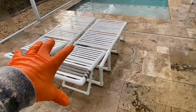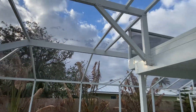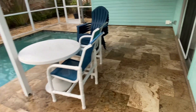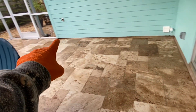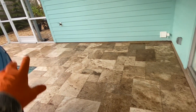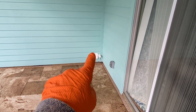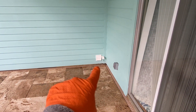Everything is in the process of drying. One of the troubled areas — what we did is we chased all of these drains, made sure that they're flowing properly to the outside, all the way around here, and that takes a little bit of work. This was a troubled area here because it had the dryer vent that just leached out a bunch of lint, clogging this whole area up in here.